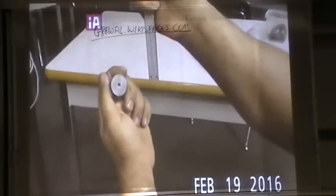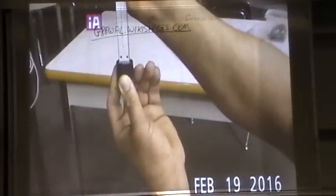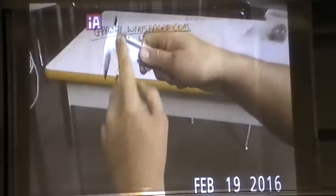I've drilled a couple of blind holes here. You put the back end of the vernier caliper over the hole, push it all the way down as far as it goes. Try not to tilt it — tilting gives you an inaccurate reading, so make sure it's sitting flat. Lock it up and that's your depth reading. So to summarize: outside, inside, and depth measurements.